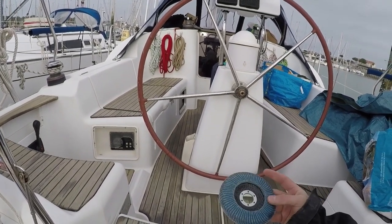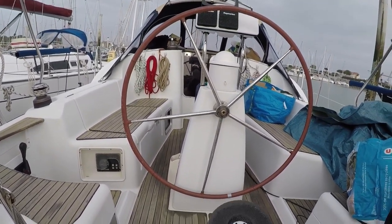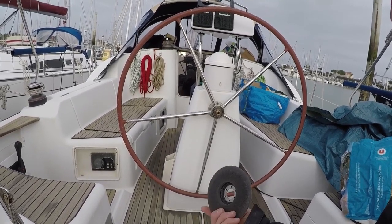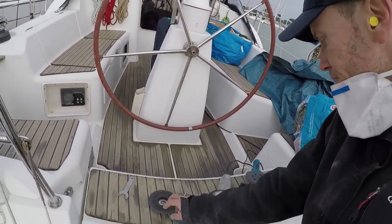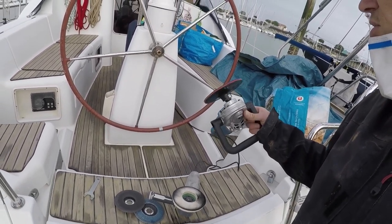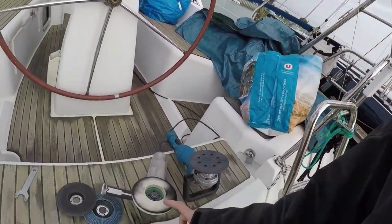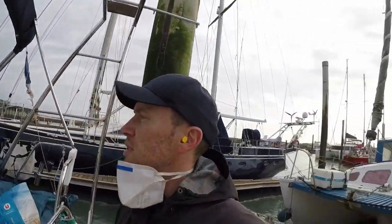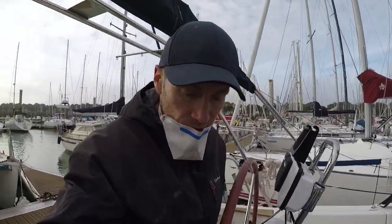So how do I do the polishing the welding? Well, I use different discs, as you can see, with different grains in order to first have a smooth surface. And then the final step of polishing, well, this is fine grain. And then the final step of polishing is done with a specific disc where you apply a polishing paste. That, I've given the information in the first video.